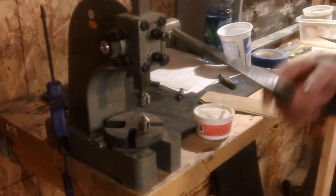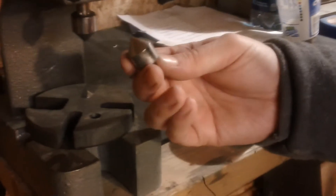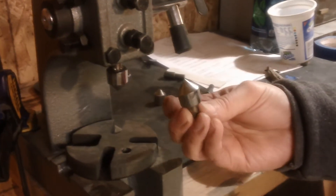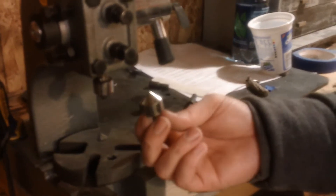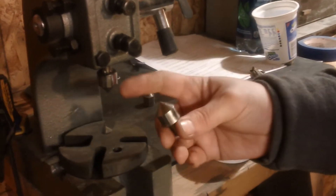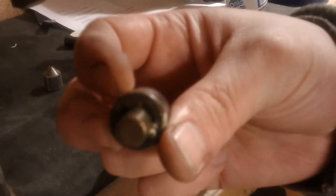What I've taken here are some dies that come with a copper tubing flare kit from Home Depot — they also sell them at Lowe's. I forget the company that makes them, but they're like $10; I got mine on sale for about $7, so I bought two of them. As you can see, there's another die there. I took a 5/16 stainless rod and put three spot welds around it.